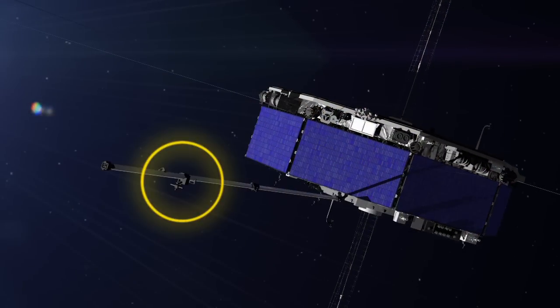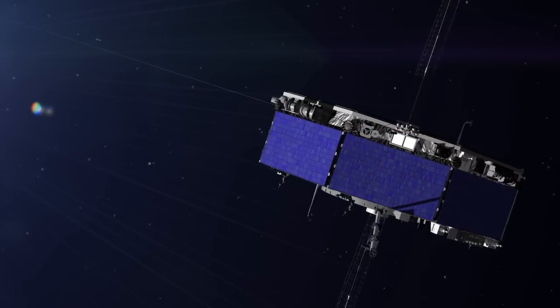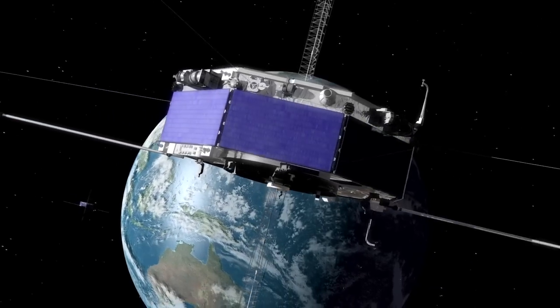There's another sensor called the search coil magnetometer — just a loop of wire connected to a suitable amplifier — designed to measure fluctuations at higher frequencies than you could get with the DC magnetometers.